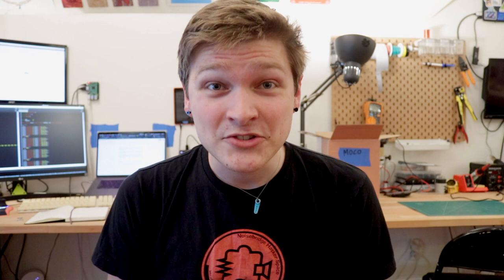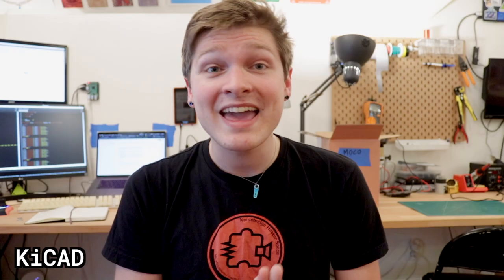For designing circuit boards I use KiCad. Eagle is probably the most popular and Altium is more of the industry-standard professional tool, but KiCad is free and totally open source — it will always be free. A lot of people say KiCad is really weird and finicky, but once you learn how to use it, it's easy and incredibly powerful. It does full 3D renders of your boards, there's really no limitation in PCB design of what you can do with it, and you can even write your own code to plug into it.